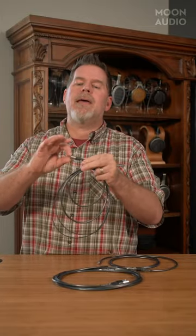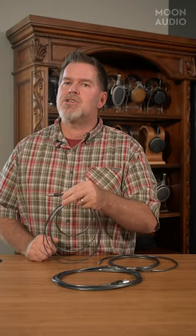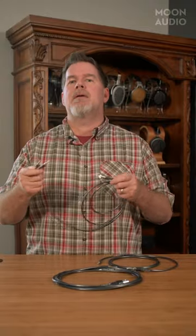The sleeve is the ground for the right channel. Problem: if this connector touches the metal base of a device, that last sleeve will ground to chassis and this can cause problems. So there is no true ground in this connector. Headphones don't have ground, so why are grounds important? It's more important when connecting portable devices, but I'll get to that in a minute.